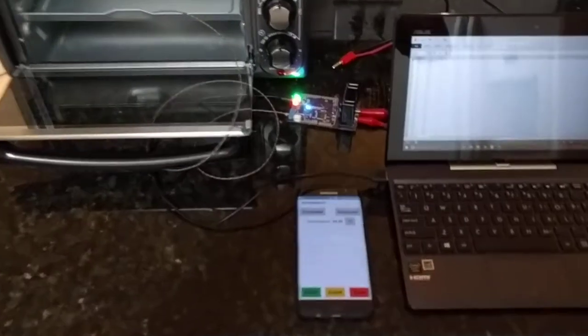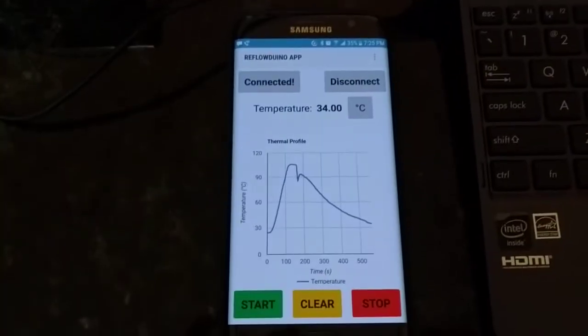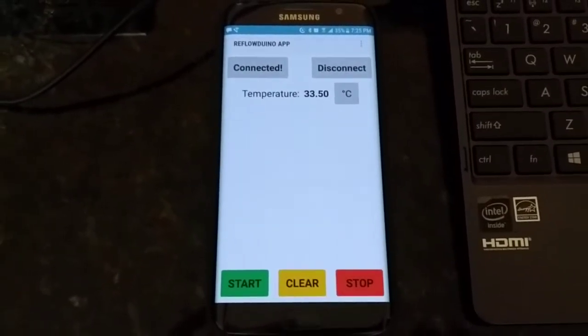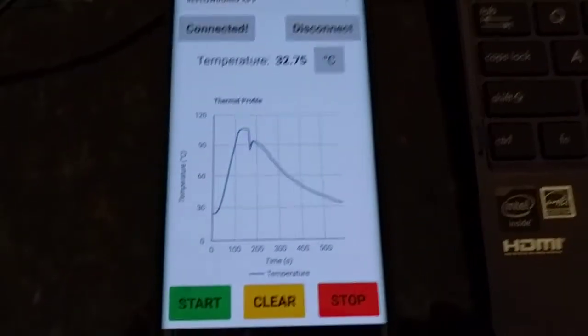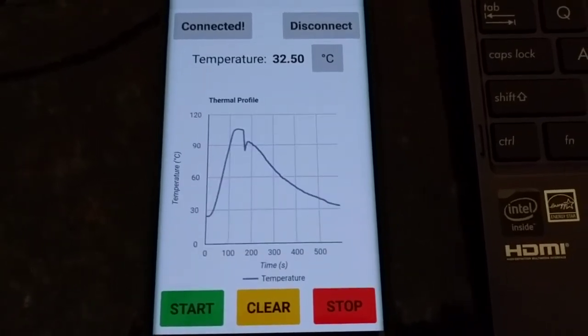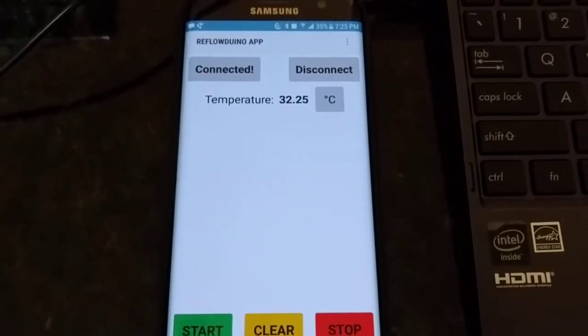We're back from waiting. As a recap, we're waiting for the temperature to go to 30 degrees Celsius, which is when the reflow process is considered complete. I could probably change that to 40 degrees Celsius since 100 degrees Fahrenheit isn't that hot to the touch. Right now it's still cooling with the door open, and the thermocouple is on that tray. That little notch in the graph is obviously from when I opened the door and the thermocouple lost contact with the plate.